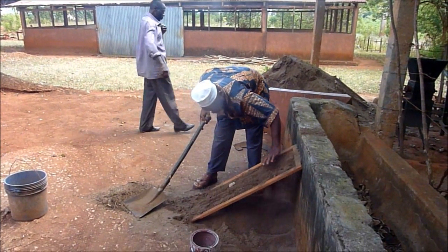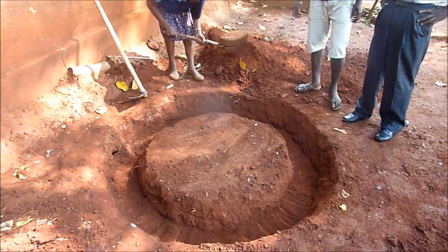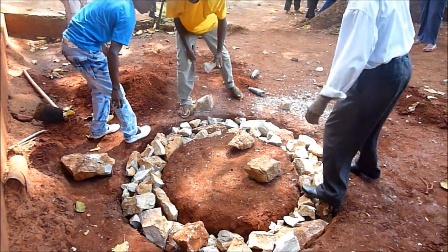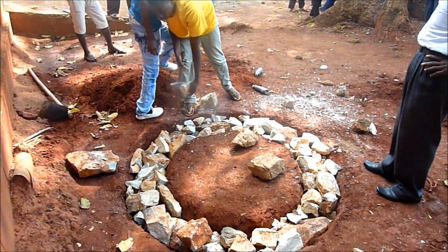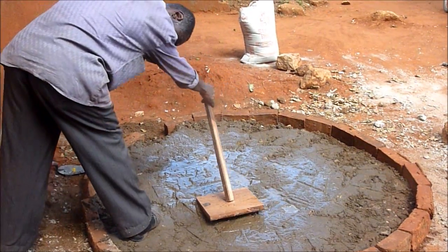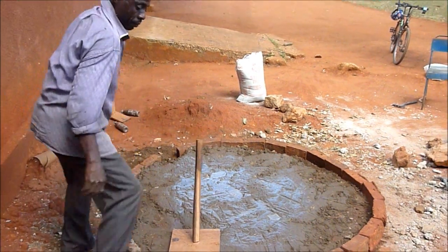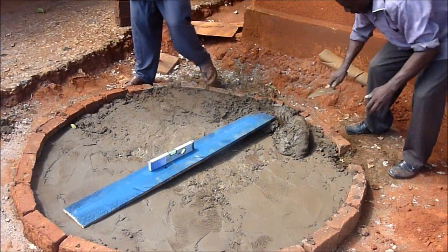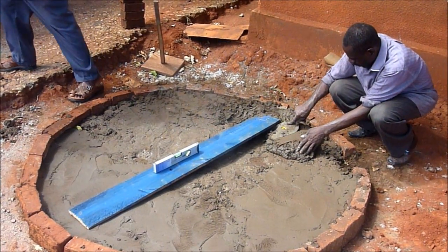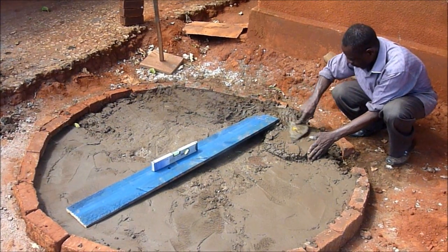After that it's time to start working on the foundation of the tank. We used some reclaimed bricks and rocks from previous abandoned building projects, along with about a 5 to 1 ratio of river sand to cement. Depending on how big a tank you do, this ratio will vary, as will the type and dimensions of the foundation you lay down. Make sure that foundation is level — having a level on a project like this is very important.